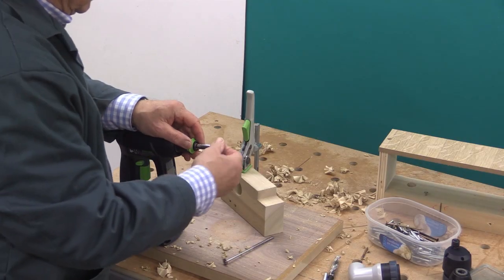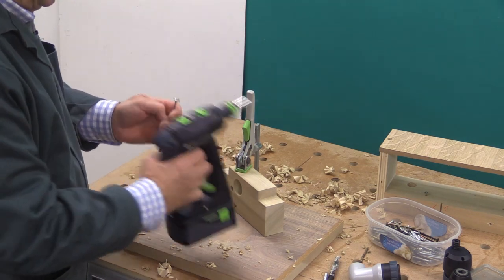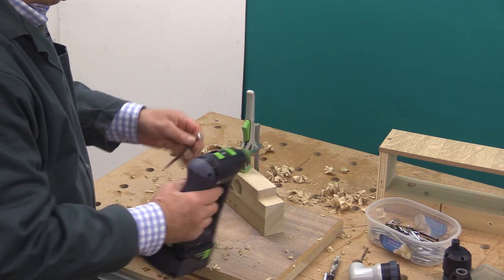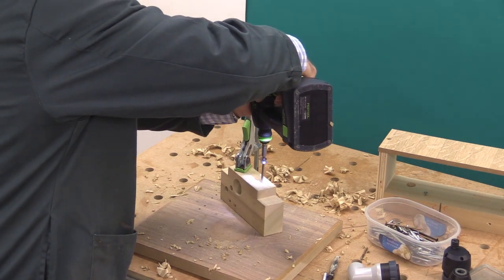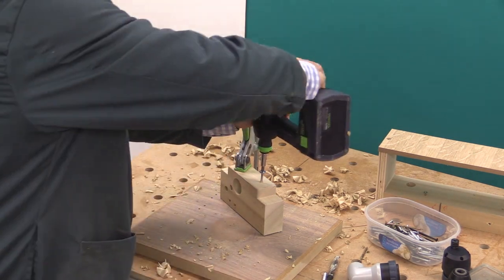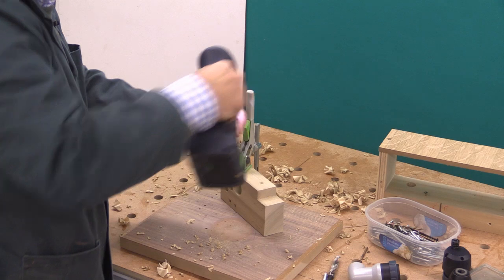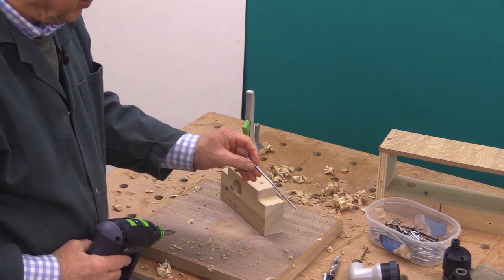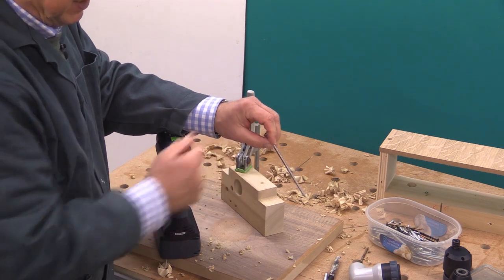Right, I'm putting a Torx bit in there. I've got this long Torx headed screw here. It's a 6mm screw. And I'm going to put this in the screwdriver position. I'm going to whack the torque up to 25, and I'm on speed 1. I've stopped there because I think I'm almost through the piece of MDF. And there was no pilot hole there at the beginning at all. Now, be careful when you do this at home, demonstrating it to friends, because when you screw these longer screws in and then take them out again, they can get quite warm.